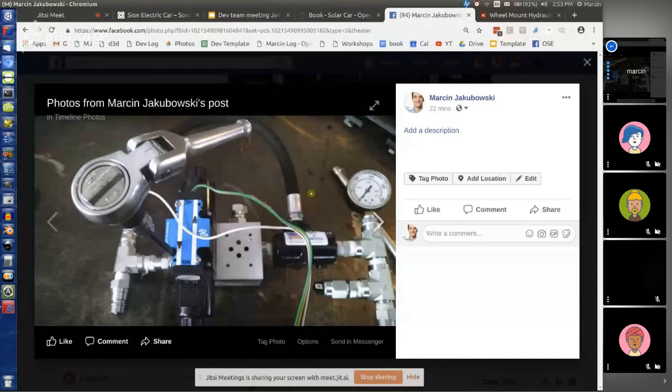Now, the practical ramification of that twice measurement, called debouncing the signal, is that there's a little delay. In the Arduino code, the loops run really fast, they probably run like a million times a second for the control code loop. So the thing that I learned, and I just had to shake this down, is the code correction: you have to put a delay between the steps that is longer than the debounce time.